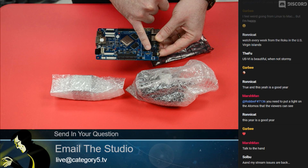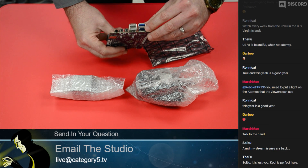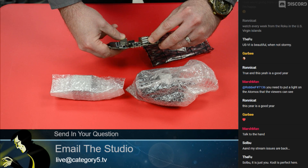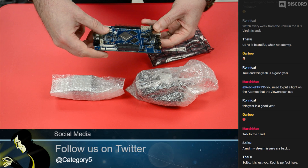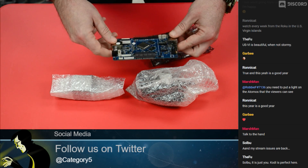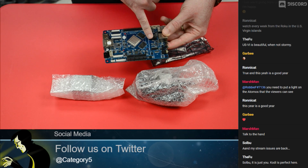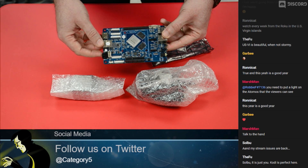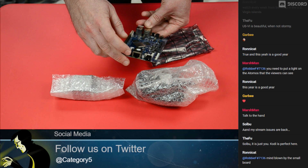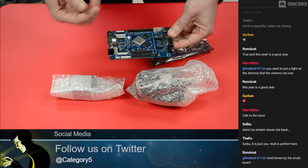There's one USB 3 Type-A port, another USB 3 Type-A, and a USB Type-C at the bottom, plus two USB 2 ports — all dedicated hosts, not sharing bandwidth with the Ethernet. The Ethernet is true gigabit, unlike a Raspberry Pi. There's no onboard Wi-Fi chip, but like other Pine 64 boards, there's a riser module you can plug in to add Wi-Fi and Bluetooth.